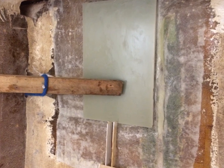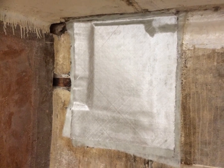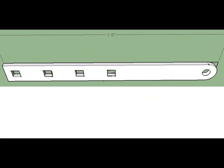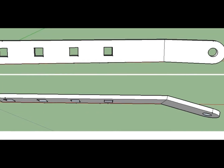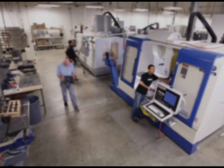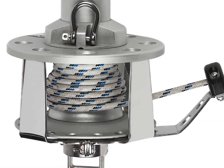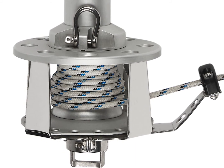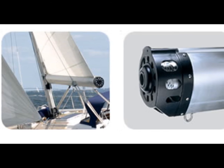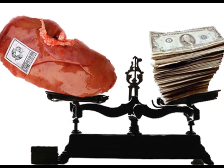I've shown before how I was replacing the steel chain plate supports inside the boat with a product called G10, a manufactured epoxy and fiberglass composite. The new chain plates will be on the outside of the hull and bolted through the slabs of G10. I've created preliminary drawings for the new chain plates, and I'm going to visit Schaefer Marine in New Bedford, Massachusetts, where I hope to have new chain plates made in 316 stainless steel. I also want to talk to the folks at Schaefer Marine about a new roller furler for the headsail, adding an interstay with a roller furler for a staysail, and eventually adding in-boom roller furlers for both the main and the mizzen. I know that will be very expensive, so I'm already investigating how much I can get from my two children and a kidney, just in case.